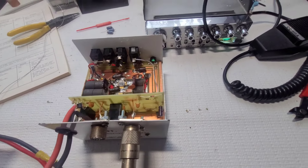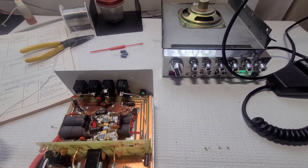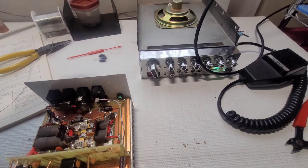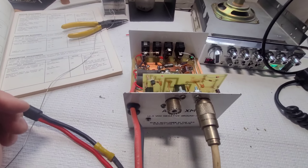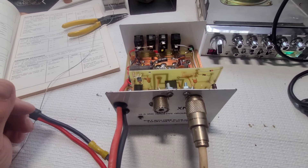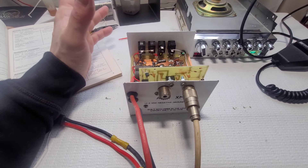I think the radio is warmed up enough to start aligning it. When I originally spoke to Nicky, he said he was running a seven-watt dead key through this and was 100% sure about that. I didn't agree — I told him it should be more like two watts dead key. It's not just the dead key you have to worry about; it's also what you're swinging. I convinced him we're going to leave the radio at a stock four watts.